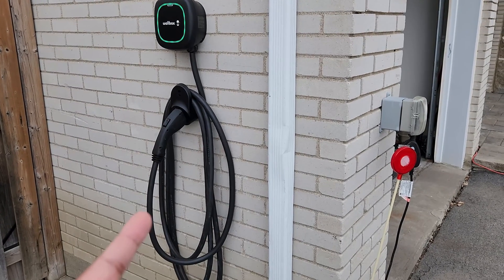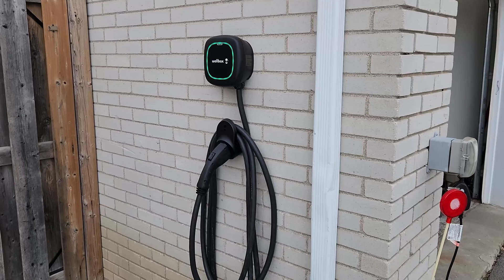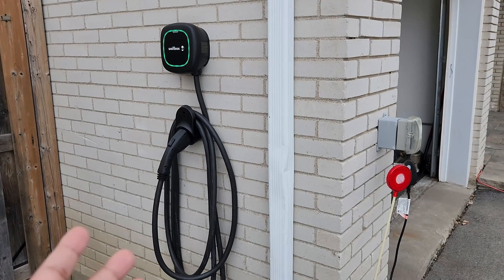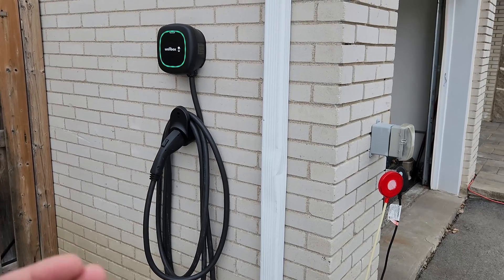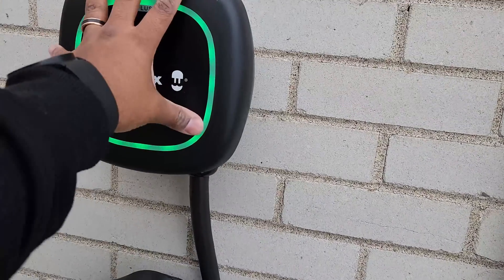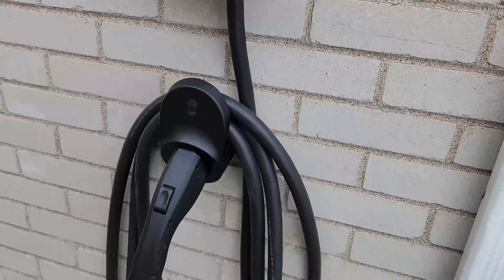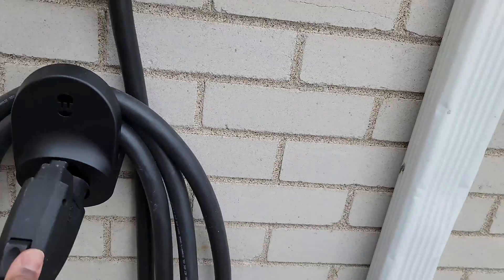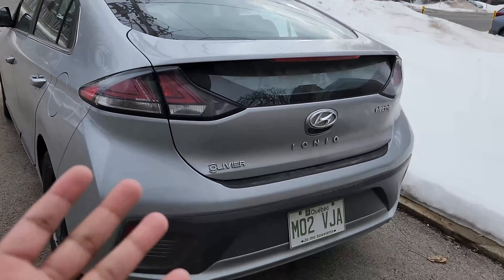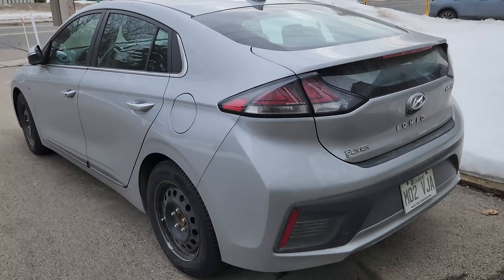The wiring for this one is more expensive — it's the same type as the Tesla one but longer, going all the way from the panel to out here. It's a long-term investment, especially if you're staying in this house a long time. Might as well do it right the first time at maximum capacity, so you don't have to redo your wiring if you get a car that takes 48 amperes later. This charger style doesn't have the wire wrapped around it, so you have a separate nozzle to wrap the cable. It's easy to use — just pull it out and my wife parks the car closer to charge. My panel can actually support both cars charging at the same time. They can both pull 32 amperes simultaneously and we're still good.